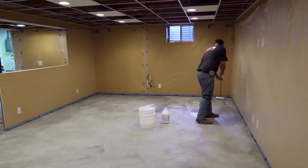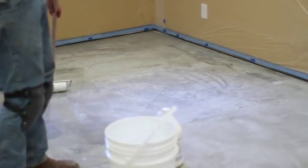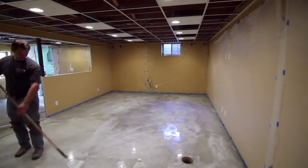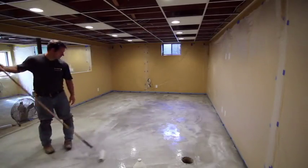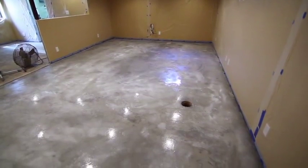If the existing surface is very rough or porous, or if the initial application of primer contains bubbles or pinholes, a second application of primer at full strength is recommended. Allow the primer to dry to a tack-free surface between coats and prior to installation of the T1000 Stampable Overlay.